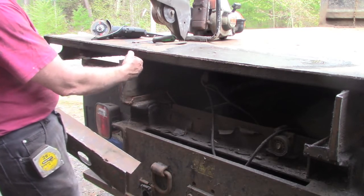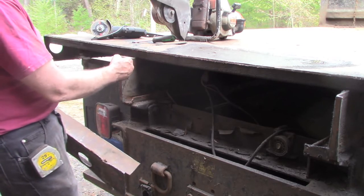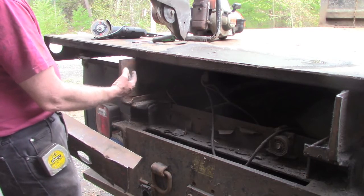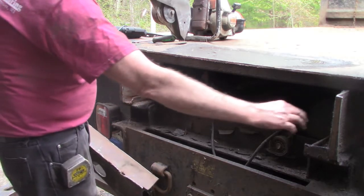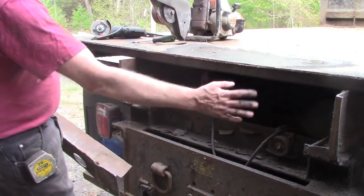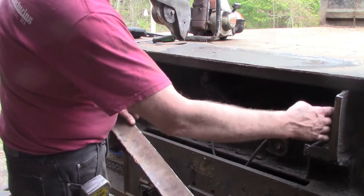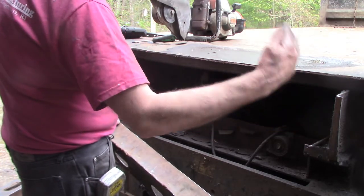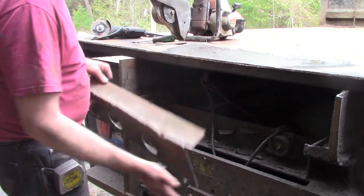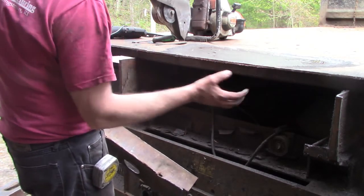That cross member is going to be solid 3/16 wall material, good rugged material, and come all the way out to the end. And then that is going to be the plane in which the rear of the body starts to get reconstructed. I'm going to put 2x4 box tubing in between here, underneath the 2.5 by 2.5, and that was never here before. The bed frames for the tilt body never had anything between them except for the sheet metal. And this sheet metal is actually an L bracket. It's not even a full section.